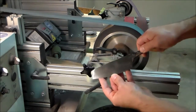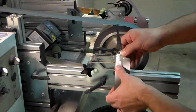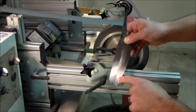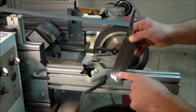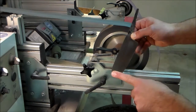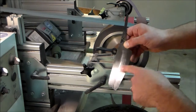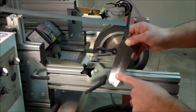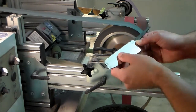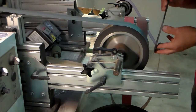I don't know if you can see this clearly. Most parts are already blank steel, and some parts you still see the pattern of the Damascus. If you still see the pattern of the Damascus, it means you have to remove some more steel. Because if you leave that, it means that some parts still have the heat scale on it, and those parts won't etch properly. Before you can do etching, you need blank steel.